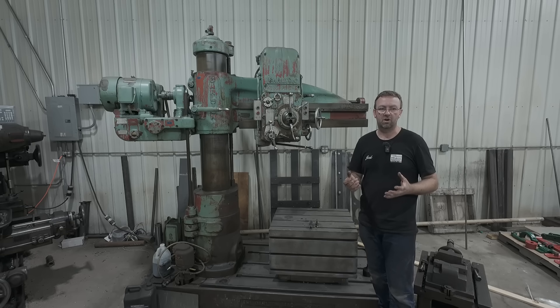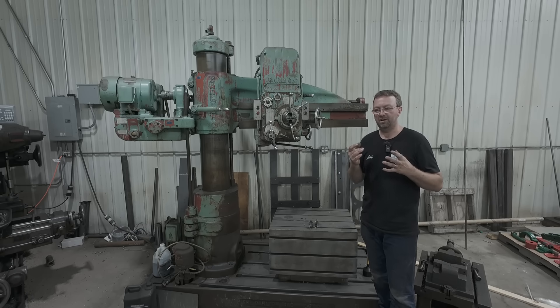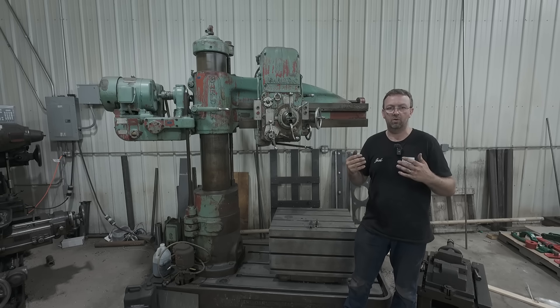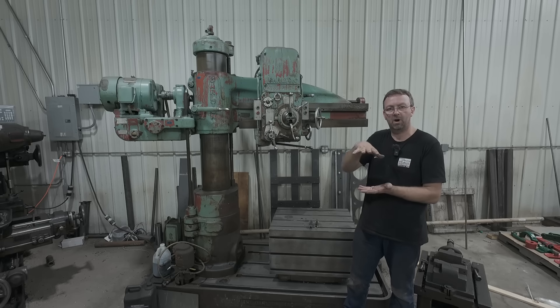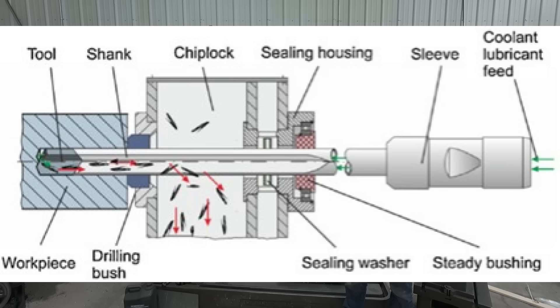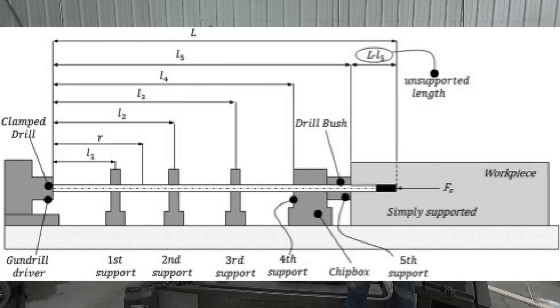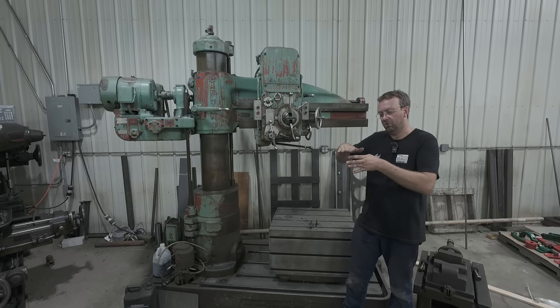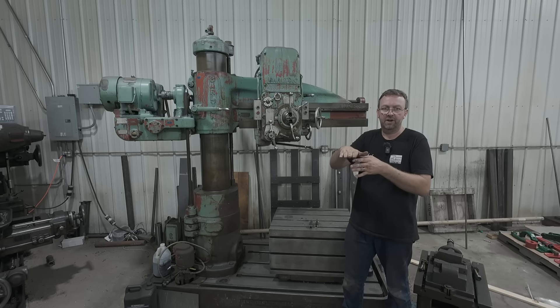There were a lot of really good overlapping questions about the gun drilling. Many of you don't know what gun drilling is, and I'm going to try to put some pictures up here demonstrating how it works. Basically, the plate would have been mounted stationary on a machine. There's a rotating spindle with the drill, very similar to one of my spade drills, and it's very long. High pressure coolant is pushed through that drill to clear the chips, and it's also supported in one if not two more places along the length of the shaft of that drill, so it's very stable. With that extra support out there as you're pushing and cutting that material and forcing the chips out with that high pressure coolant, it's going fairly straight.